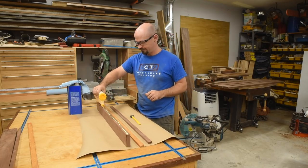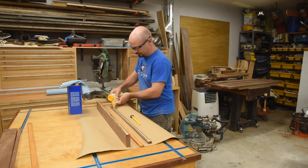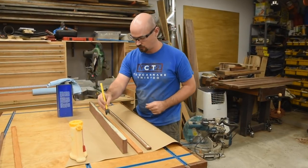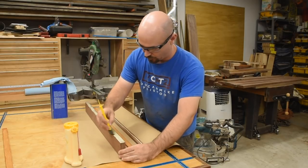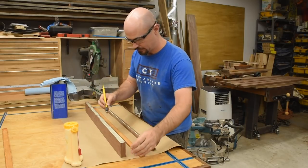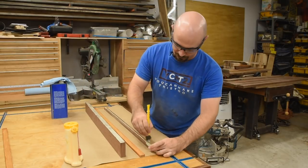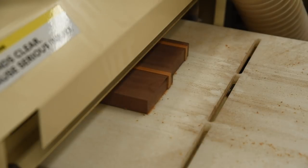This is actually a bit of an afterthought. I really like the idea of the pinstriping on the legs, but I didn't know how I was going to carry it through the design to make sense. Then it hit me that what I could do to tie everything together is to put it on the armrest, so that way it looks like the orange heart is sort of a slice going straight down through the legs and armrest and everything. Off camera I cut all these pieces, made a bunch of test cuts to make sure I had a walnut strip and orange heart strip the same size. After cutting the orange heart, I wiped it down with denatured alcohol this time, which is better than the mineral spirits I used earlier because mineral spirits leaves a little bit of a residue. After the glue dries, I run the armrest through the planer to flush them up.